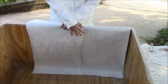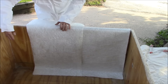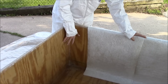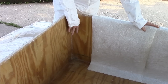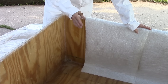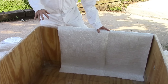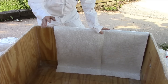People ask, are you going to see the overlaps? By the time you do the two coats of gel coat, you're not going to see the overlaps. So you keep going around and around. For the corners, you're going to cut pieces about 8 inches and do corner pieces around 8 inches. You can do that before the first coat or after the two coats — it really doesn't matter because it's going to be underneath the gel coat in the end. Just imagine going section by section, working your way all the way around until you've done the entire pool. Then you do the floor.